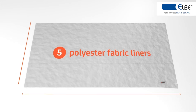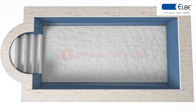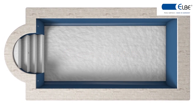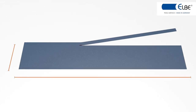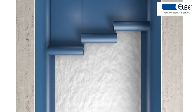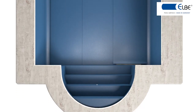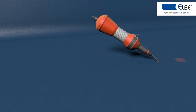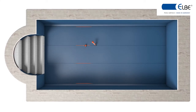Polyester fabric liners are cut again to meet the dimensions, followed by the laying of the tracks. Similar to the procedure in the lining of the walls, the swimming lanes for the pool floor will now be cut. One starts from the edge of the pool floor when laying out the floor in order to place the pool lanes with an overlap. Then fix again selectively using the hot welding equipment. When the tracks are perfectly aligned, they can finally be welded.